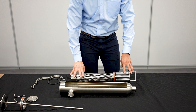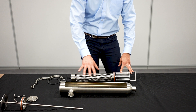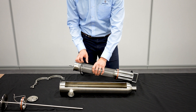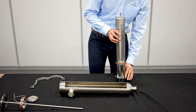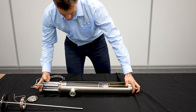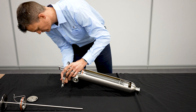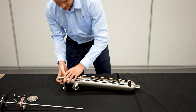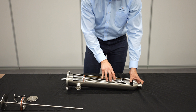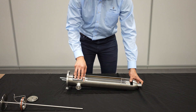So now we have our fully assembled magnet trap strainer. We're going to put that back into our process strainer line. This doesn't need to break your process at all — you can leave this completely in line during all of this. I'm going to slip on the four inch tri-clamp gasket over the top and then put this all back inside. Now I've fully inserted my magnet trap strainer element. Using my perforated element I'm able to have fine particulate straining, and now with the new magnet trap insert I also have magnetic straining capabilities as well.